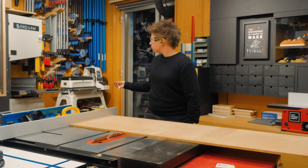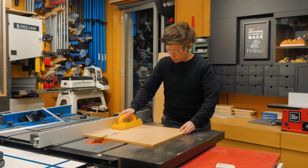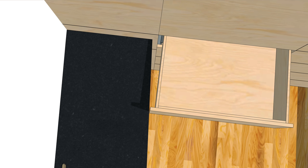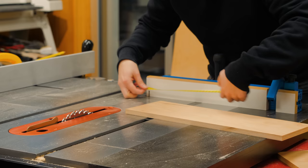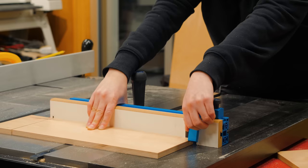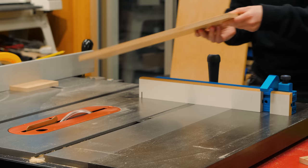Here's my new dust collection in action. Here I was cutting the piano drawer side pieces. The construction could have been a lot simpler if I had more space, but there's not much I can do about that. I had a maximum depth available of 46.5 cm in order to guarantee the opening of the wardrobe drawers. I also wanted to use 15-inch drawer slides that I had, to create room to hide the keyboard, computer and other electronic cables. This is the design that I came up with, although other possibilities are explained in the building plans.